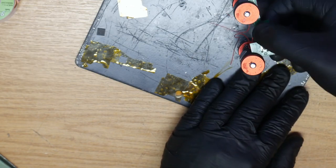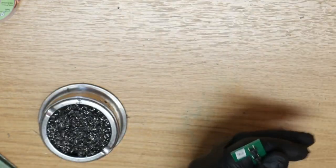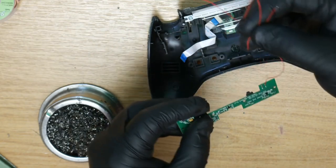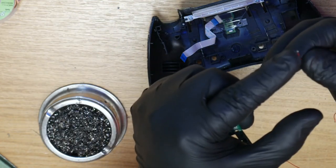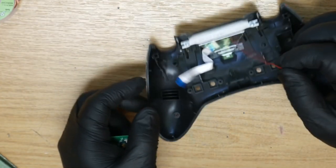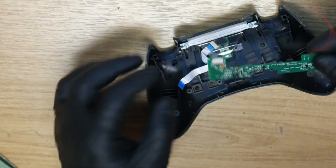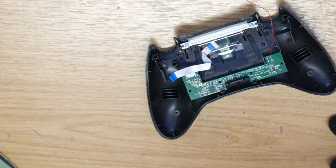That's done. We'll put that back in the shell. Usually after a bit of manipulation these wires break off — they're called Kynar wire, one solid core rather than lots of little strands. Stranded wire stands up to bending; these don't. They're for electronic repair, bodge wire, modding — where they're not under any stress. As soon as you start manipulating things they tend to break off. Plenty of length there — just strip the end and solder it back on when needed.